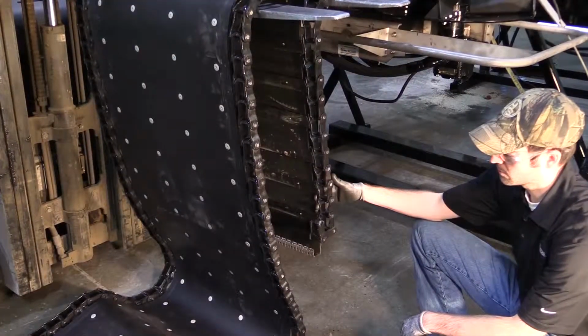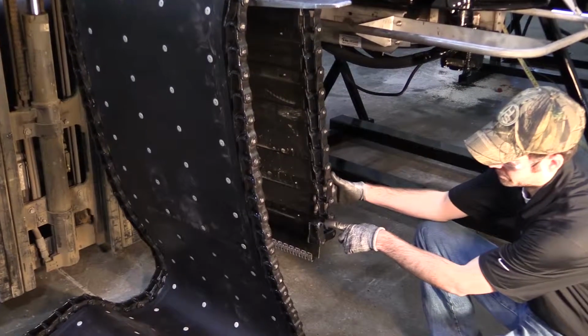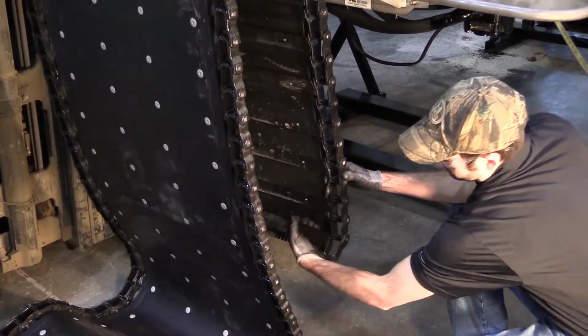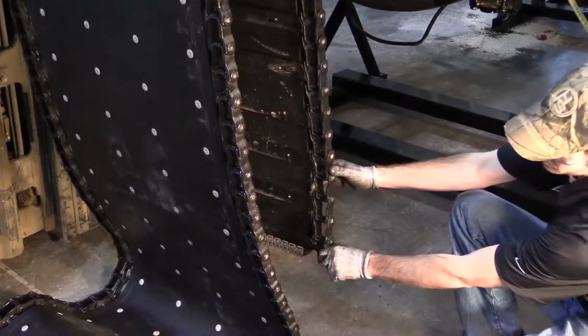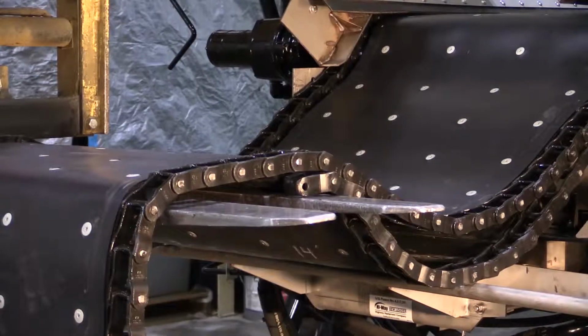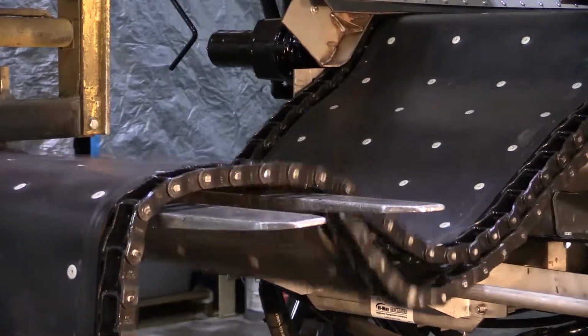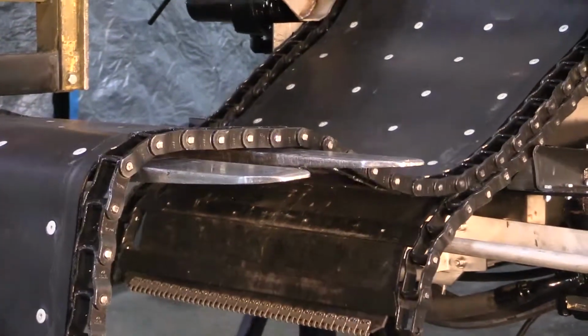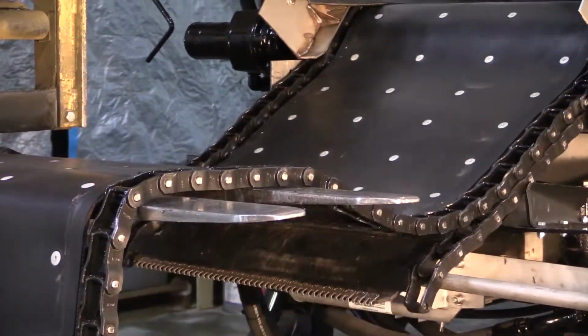When the new conveyor is nearly unrolled, stop the process. To prevent the new conveyor from jamming, make sure the end of the new conveyor is completely unrolled before proceeding. Continue with the installation until the belt splice is centered within the sill cutout. Stop the conveyor and remove the installation brackets.